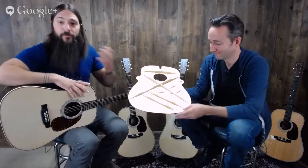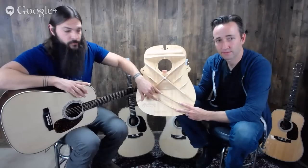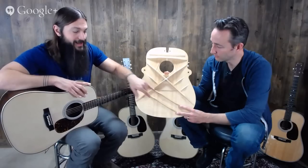So you guys might know I love D35s. And Lee just wrote in, and he says, compare it to a D35. I think that is an extremely awesome question. D35 has 1/4 inch bracing, and if you were listening to the specs on this, we changed the tone bars to 1/4 inch. I have this, like Tony's Wonderland workshop right now. When I refer to the tone bars being 1/4 inch, it's these two transverse braces along the lower bout, these two right here. Everything else on the HD-28 Special is 5/16, the cross braces, etc. On a D35, the cross braces are 1/4 inch, as are the tone bars.